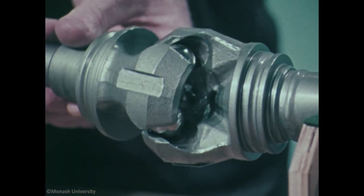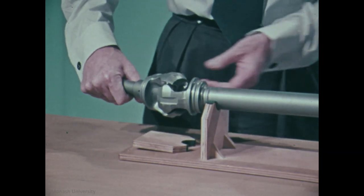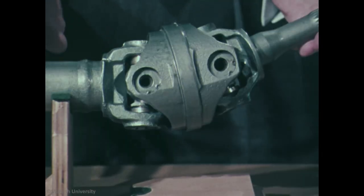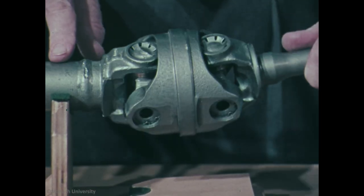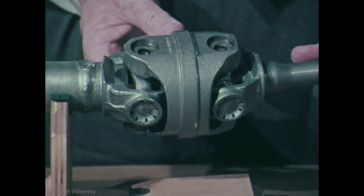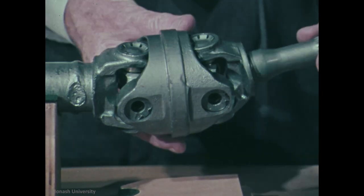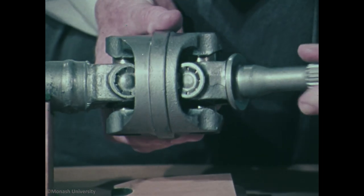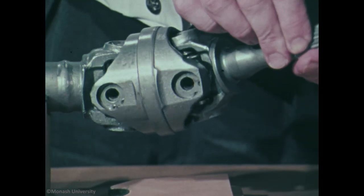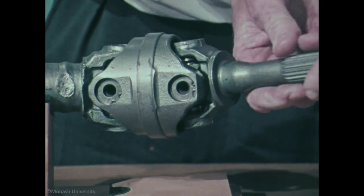There are other couplings, differing in some details, some of much larger size — for rolling mills, for instance — all using balls and tracks. One can also use two universal joints placed close in series with one another, with a central symmetry-preserving device concealed inside, which succeeds in bisecting the angle between the shafts very nearly accurately, but not quite. This kind of coupling is very sturdy and sensible for front wheel car drives, but it's not absolutely 100% precise.